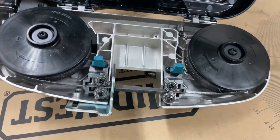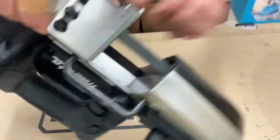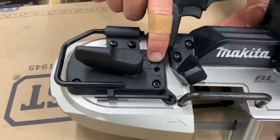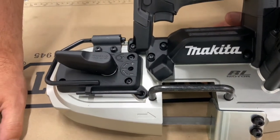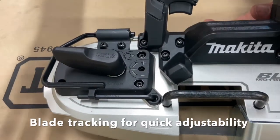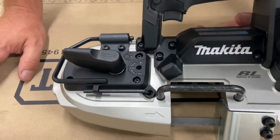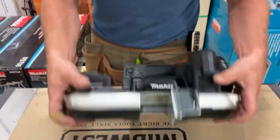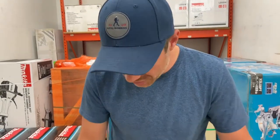There's a little clean-out tray — let's see the insides a little bit. Another nice thing is tracking. In the past, people have had problems with the bands coming off the front or going back and scratching the housing on the inside. This is more like an upright bandsaw where you've got adjustability to tilt the wheel forward or backward to let you center it, which is huge in bandsaws — being able to balance the blade and not have it come off or cut your plastic on the front of the housing.